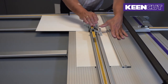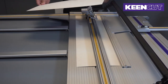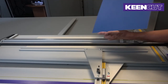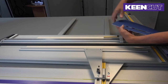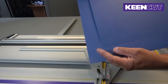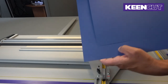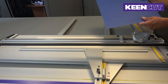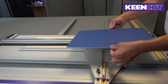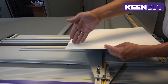Push the blade in before you release, then pull it all the way towards yourself. As this is the first mount I've cut on this machine, I will turn it over. After the first two cuts, you can get an indication as to whether it's over-cutting or under-cutting. We have an undercut on this cut and an overcut on here. We need to analyze whether that is at the start or the end of the cut. Because the board is upside down, the start is at the top.